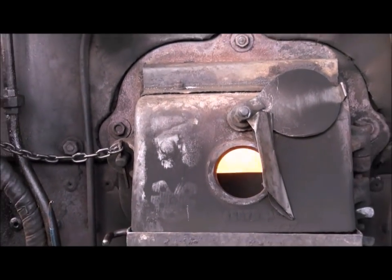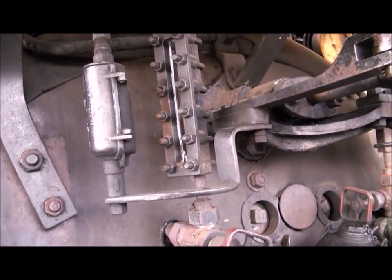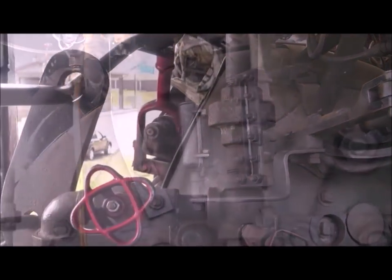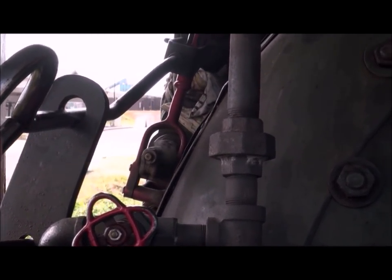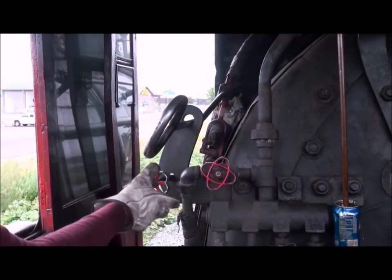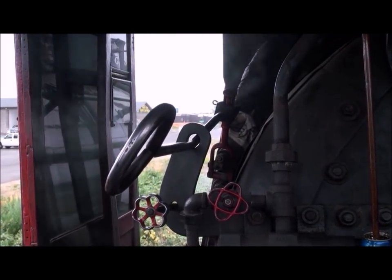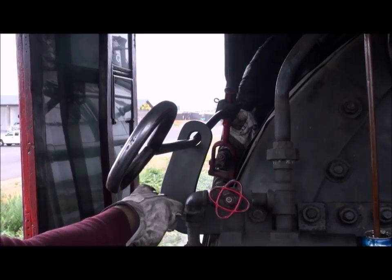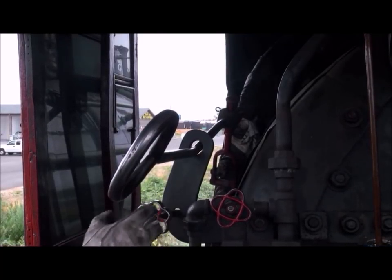It's time to talk about my personal favorite side — the fireman side. I like driving the trains but I like firing a little bit better because there's always something to do. The first thing you've got to worry about all the time is how much water is in the boiler — if you get too much, you're going to suck it up, and if you get too little, it's going to blow up. The way you keep it from running out of water is the injector. You open the water valve a little bit, pull the injector rod, and make sure that it's working — otherwise it's going to be blowing steam out all over the place. You want to make sure you don't bring the pressure of the boiler down more than five PSI, as it damages the boiler.